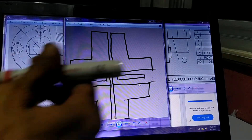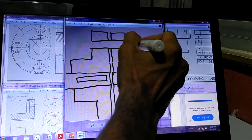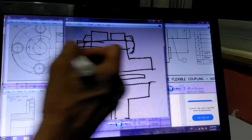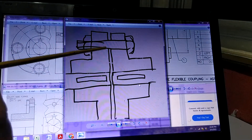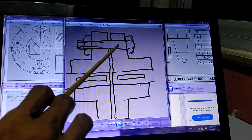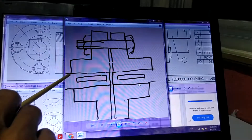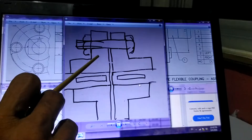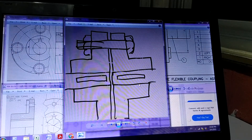To transfer the power from one rotating coupling to the other, a nut and bolt is fitted between the two flanges. One bolt is put from one side and a nut is fitted on the other side, connecting the two flanges. When one flange rotates, because of this bolt the power gets transmitted to the other flange, which also rotates. Through the key, the power goes from the flange to the second shaft. Power transmits: shaft → key → coupling → bolt → other coupling → key → shaft.